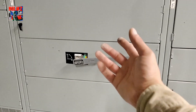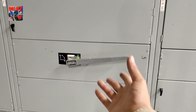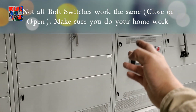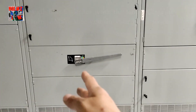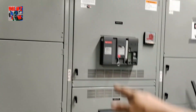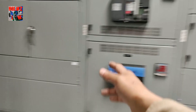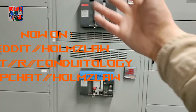This is what we call a bolt pressure switch. This switch is what's actually going to isolate or turn off a section of the service. In our case, this switch here is going to turn off this section here, which has two other switches — so that bolt switch will turn off or turn on these two switches.